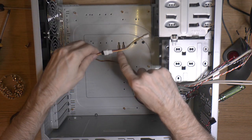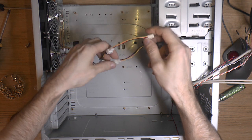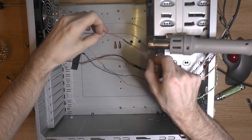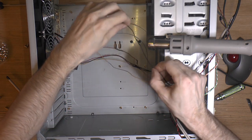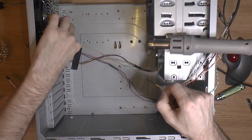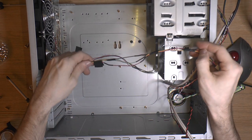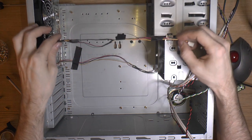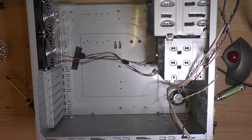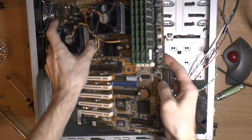So what I think I'd do instead is I'm just gonna cut these off and remove these in the middle. Permanently install these as extensions. That way I don't have to have this clamped on the motherboard, which I don't want to. Now we have one of the worst looking cables ever. There's some tape to hold them together a little bit. And we spliced them in three places, because it's too short. But at least everything is spliced and shrink wrapped, so no risk of short or anything like that. So now let's try the motherboard again. I lost count, but just try number N, I suppose.